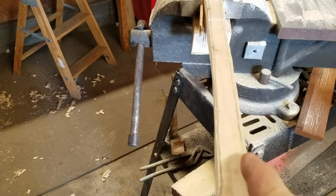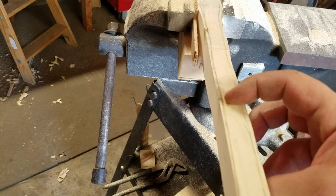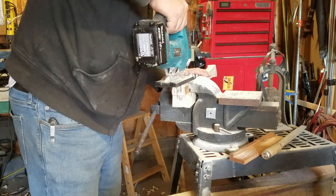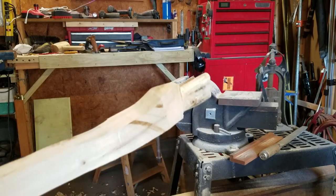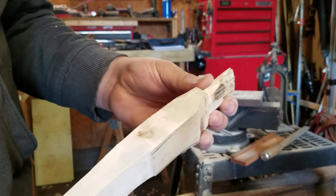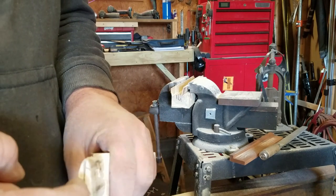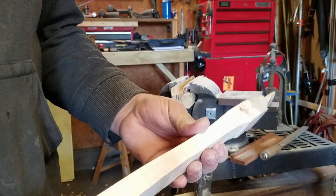So now we're just going to work the corners down to these inner lines, and that should get rid of this last little pinhole. I went and re-watched Mr. Chickadee's video myself last night and it's kind of funny — he's using different techniques than me. I don't have a draw knife, it's one of the things on the list, so I'm going to do most of these round overs with a rasp. He cut the tenon almost all the way down, but he's using a soft wood wedge and I'm using a metal wedge, so I don't believe I'm going to cut it down that deep.